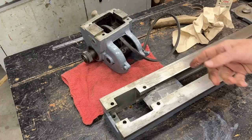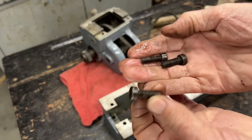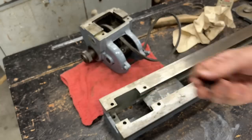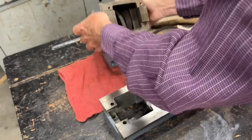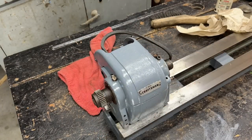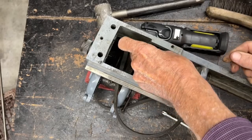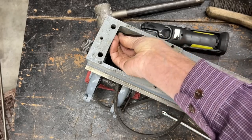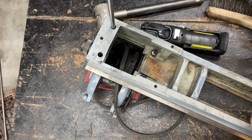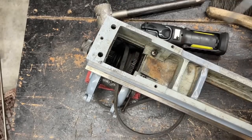Then I'm ready to put this on, but I will have to install these four Phillips cap screws. I don't know why they use Phillips — nowadays I think they would use socket head type screws. I've already put two screws in there, there's number three, and number four. These two have to be accessed through these clearance holes, and that is why you have to take the pedestals off — the feet, or whatever you might want to call them. So I will tighten all four of those very securely.